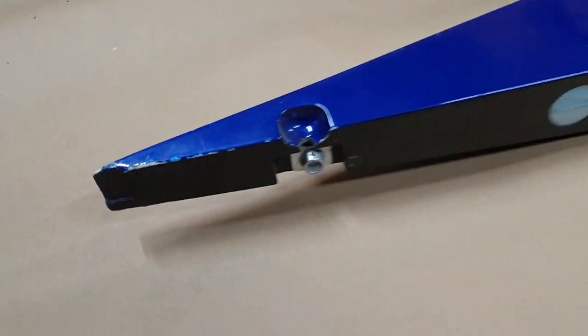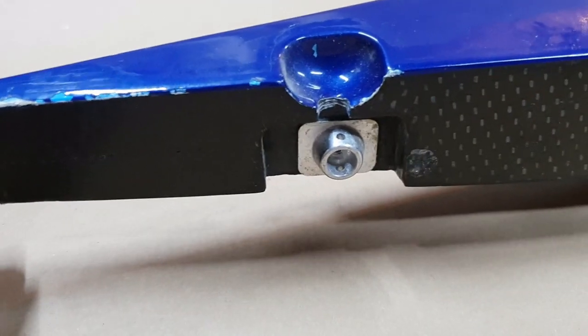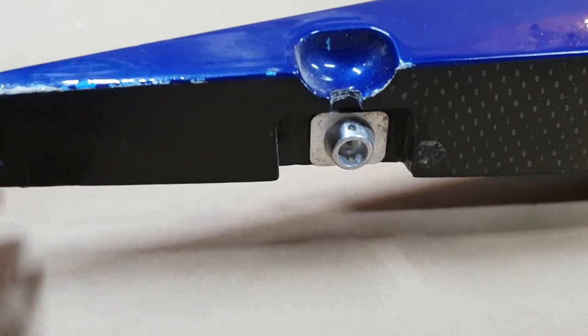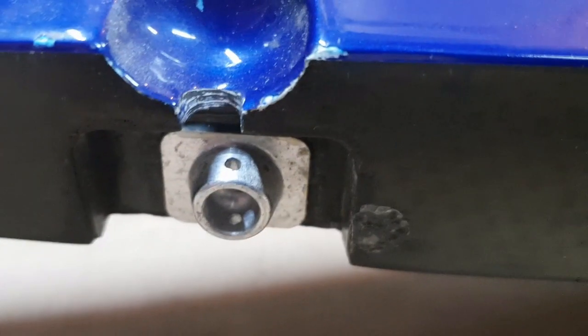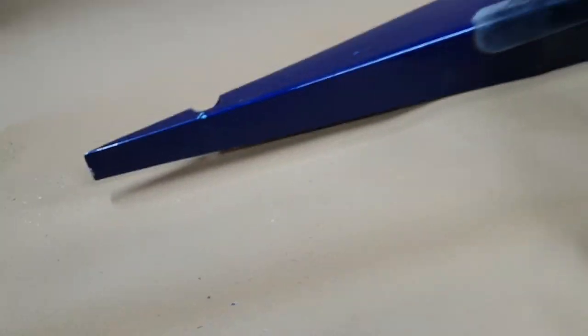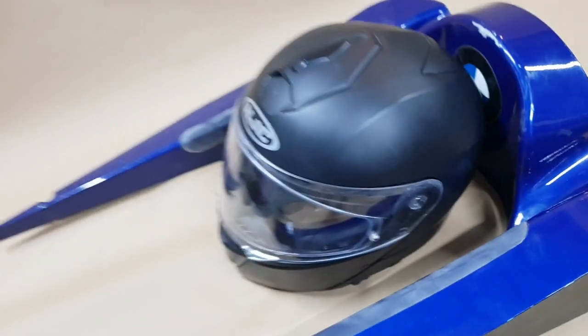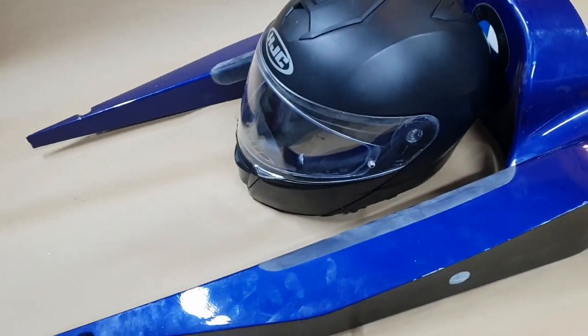if I just spin around to the clip on the front, they're quite simple. These would locate into, again, dowel pins that are sticking out from the monocoque, and then you would put a clip down there, a clip down here in the top, which would lock in that pin. So pretty simple. In terms of getting out, you pull your two pins here and this one here. This would lift up, the whole thing would hinge up like this, and you could lift it away, and then the driver could get out.